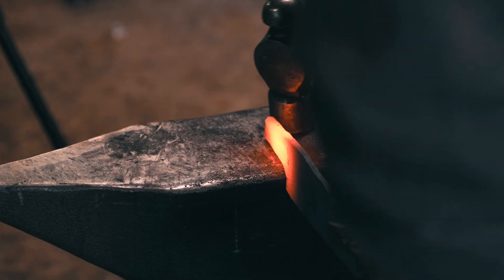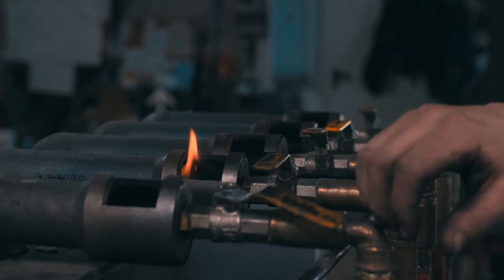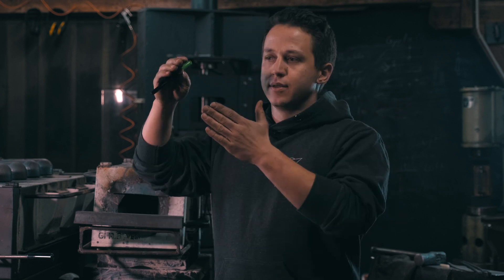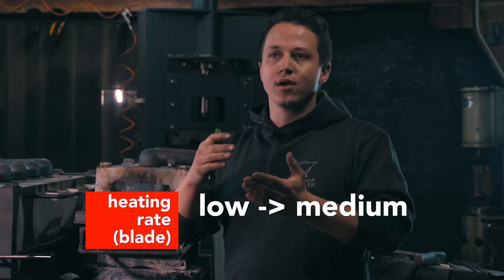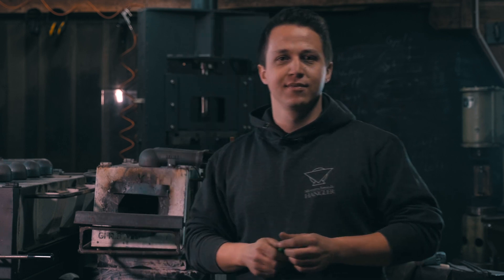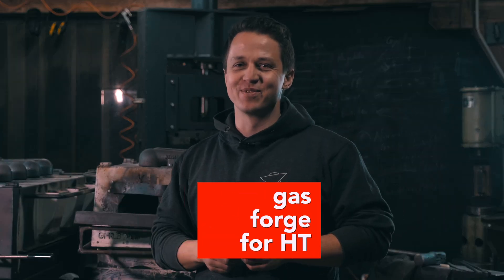Lastly, we're talking about the heating rate of the knife itself. As we want to reach a certain temperature and not just any temperature, we need to regulate the burners down as much as we can — maybe even put in a piece of metal or tubing to eliminate most of the convection, because the gas burner itself is hotter than we want. In order to reach a homogeneous-ish temperature, we trim back the burners as much as we can, which results in rather low to medium heating rates. So basically, gas forges aren't very good for heat treating — they suck. You only use them because you have nothing else.